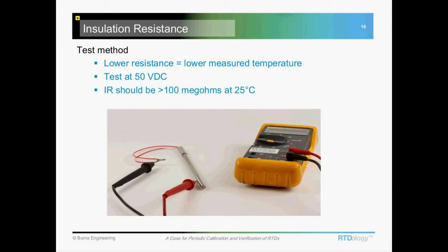Those higher-voltage tests are done to expand confidence that the sensor will perform properly at higher temperatures, because as the probe temperature increases, the insulating material's properties decrease and the insulation resistance decreases. So a sensor that starts at 500 mega ohms at room temperature might be down to around 20 mega ohms by the time it reaches 400 or 500 degrees C. It isn't necessary to have that huge insulation resistance at room temperature, but sensors are manufactured with that higher rating so they work correctly at elevated temperatures.